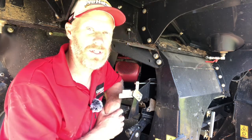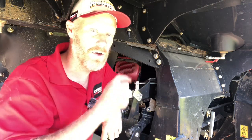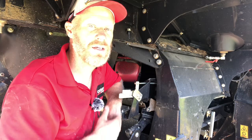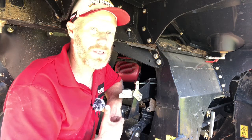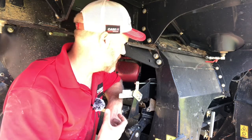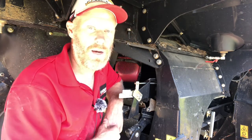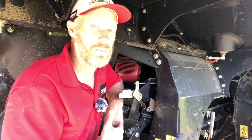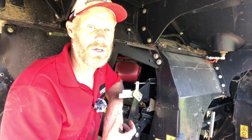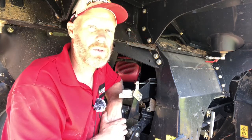Now the sieve in this machine is a corn slat pre-sieve, available through parts. It's got the deep notch that goes down almost to the wire. With that sieve, you're able to run a tighter sieve setting, still get the capacity in corn, but it helps keep some of the cob out of the sample. The catch is you've got to run it tighter than what the book says — the book doesn't really have settings for it, but if you go to a mid-range operator's manual and look at an upper corn slat sieve, that's about where you want to run it. So typically, instead of 10mm, I'm running around 6mm with this corn slat pre-sieve, and I'm calibrating my fourth notch to that 6mm.